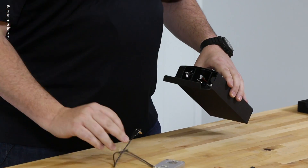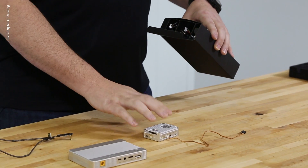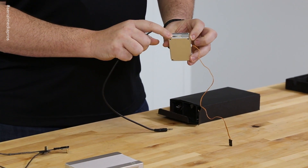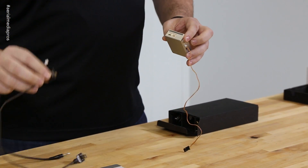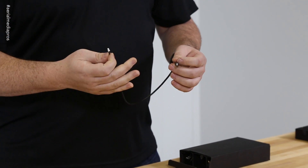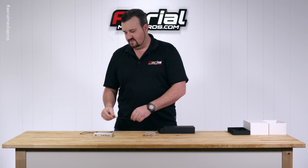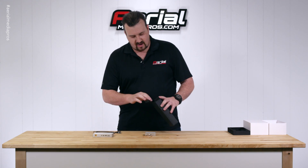Looks like they give us an HDMI cable. This will probably go from the camera system up into the LightBridge. This is an SD video port as well — you'll see there are two ports right here. One is the HDMI downlink, which is where this one plugs in, and then you have an SD downlink. If you guys remember on the GCU of the Zenmuse, it has a video out — you can plug this straight in and get that SD video. So you have both options: you can either do SD video or go with the HDMI wire and get HD video.